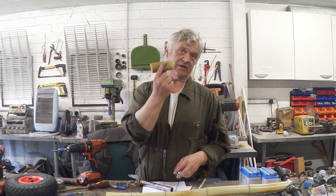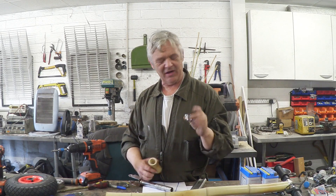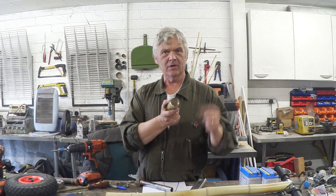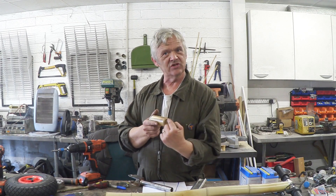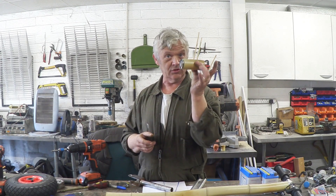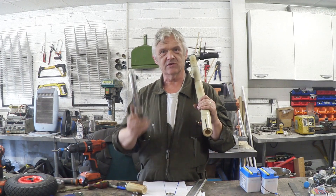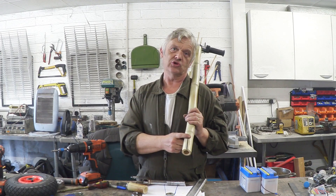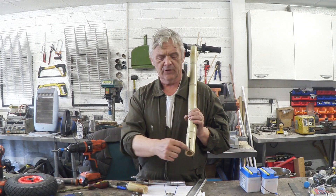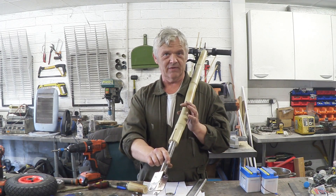A couple of interesting details about the steering head. The steering column itself I'm going to make from a piece of bamboo, because I've got these steering head ball-bearing cups — they come off a bike and slot rather nicely into the bamboo, so the ball bearings will run on metal. Bamboo is incredibly strong in compression but splits easily laterally, so we need to bind it properly. For the steering column I'm shoving the forks in; there's a drill hole and a slot cut — the drill hole stops any split from progressing up the bamboo, and the slot gets clamped down with a couple of hose clips onto the forks.